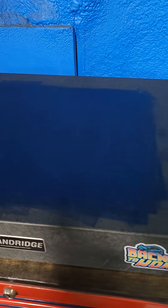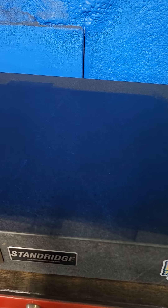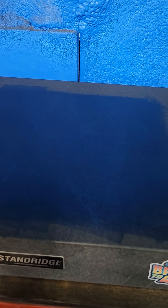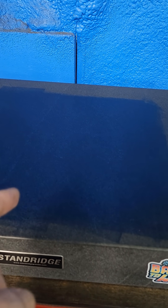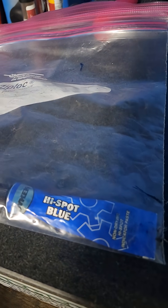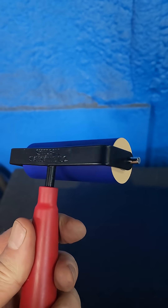So this is my surface plate. It's inked up — I've already had one of the plates on there already. This is a lab-grade plate; it's the flattest that you can get. That's my ink, and you don't need very much. This is my ink roller, which came today, finally.